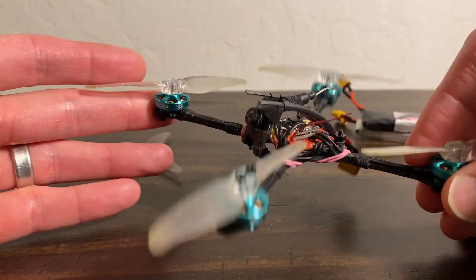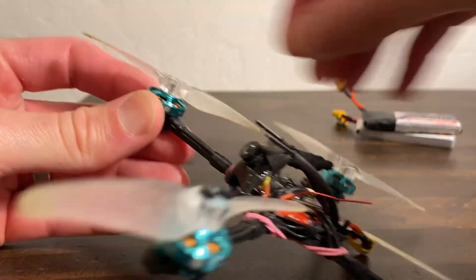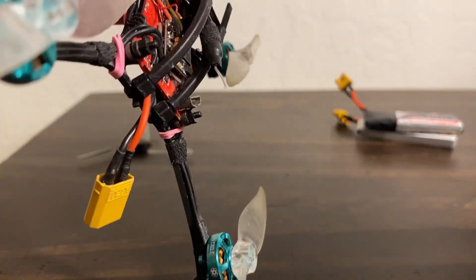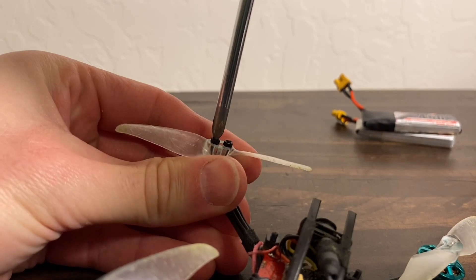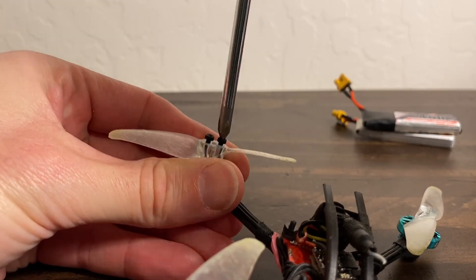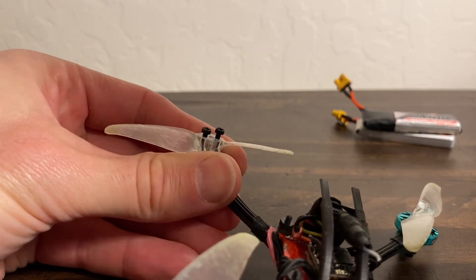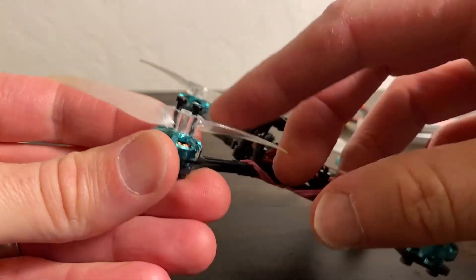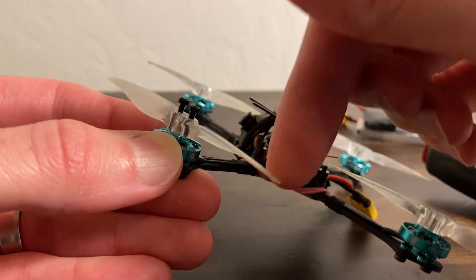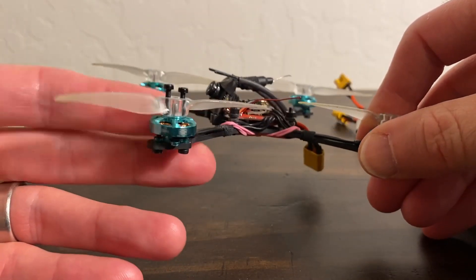The main failure is these things aren't immune to — if you're really torquing on the props, twisting them back and forth to pull them off — the bell loosening up from the motor shaft. The nice part is you can just pop in the screws. Once you've loosened it up, let's get these screws out. These are just little nylon screws, so the weight isn't terrible. Watch how easy this spins — with light finger pressure you can see how that shaft just spins really easy in the motor bell, and that's enough to cause funny little motions when flying because it slips.